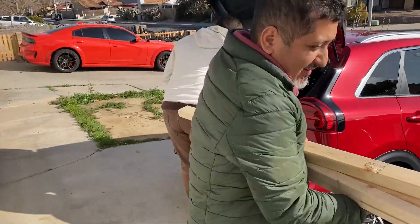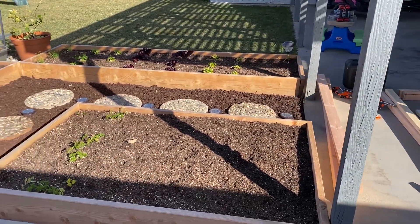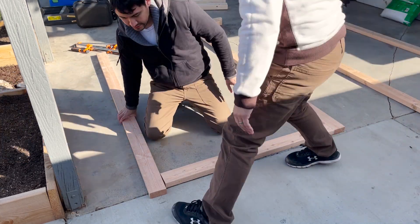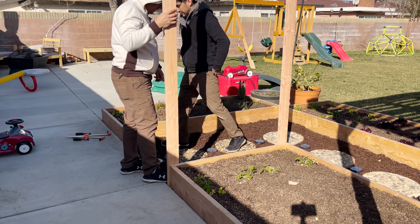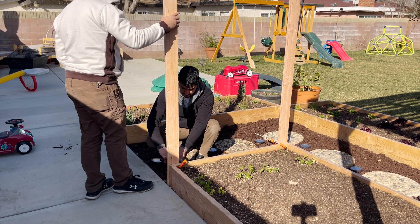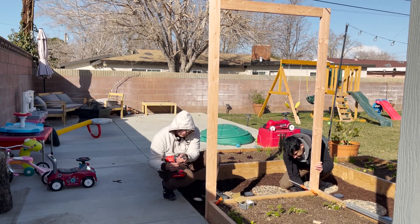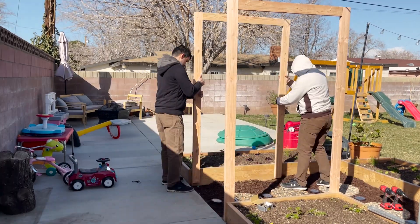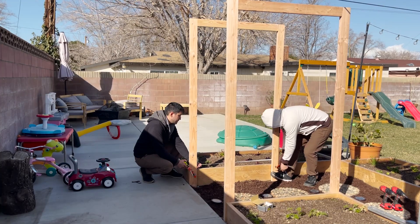We got to our compadre's house and were able to start setting up everything, which was nice because we got everything done pretty fast this way. Cutting everything not on site was kind of challenging mentally, only because I've never not been able to re-measure in case I thought I might be off. But I was so happy and relieved to know that everything fit perfect. We used a clamp to hold up the trellis so we could do the pre-drill of the hole, and then we measured the other side to make sure it was four feet wide like the other one so it could be square.